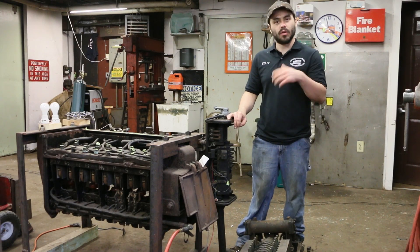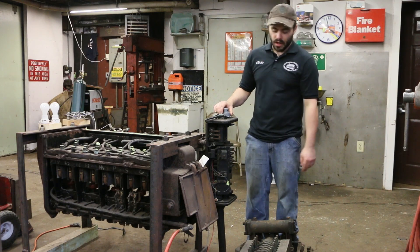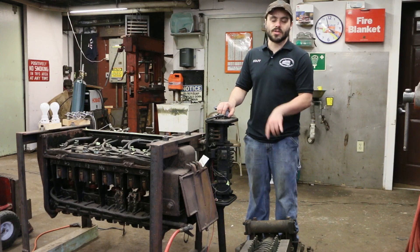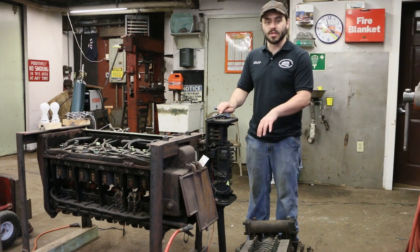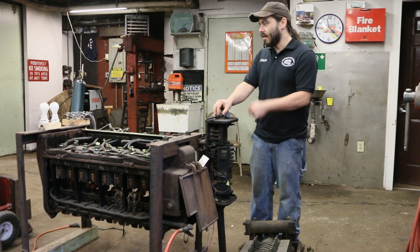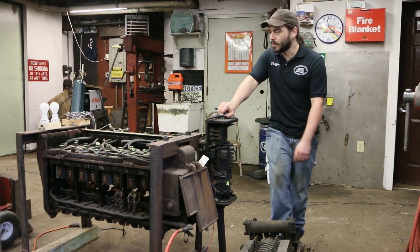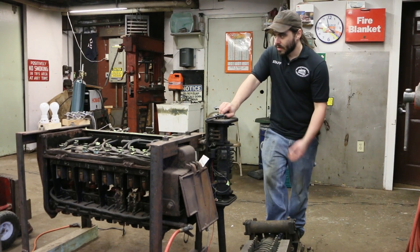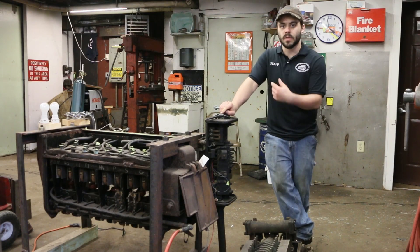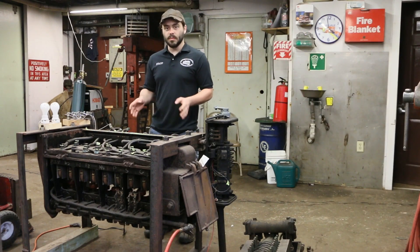The magnet valves are controlled by a low voltage supply fed into the master controller. We've made a couple of jumper connections where interlock connections on the reverser would normally be made when properly set up — we've jumped around those for now. We also have a higher voltage supply representing the trolley voltage to show the effects of switching contacts as the master controller advances.